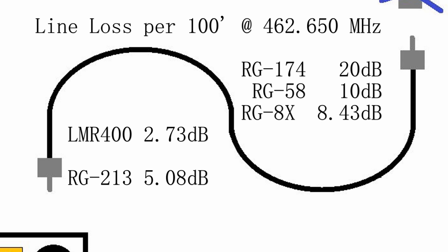These losses are listed per 100 feet, so you just divide by how many feet you're using to get the dB loss for your system. If you have 100 feet of RG174, that gives you a 20 dB loss — that's super high. The standard cable, usually 16 feet for a car installation, is going to be a 3.2 dB loss. So that 3 dB gain antenna you put on your car, thinking you're going to take that 10 watt system to 20 watts, is now back to 10 watts.